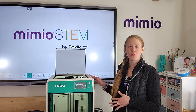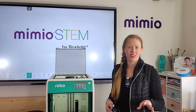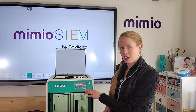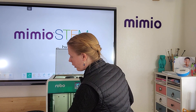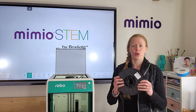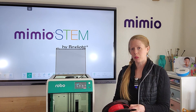Once you've cut the spool of filament and unloaded your previous roll, both loading and changing filament are exactly the same. Click start in the bottom right corner and get your new spool of filament ready. When you click start, it will begin preheating your 3D printer. So grab the new spool you'd like to use and feed it onto the back of the machine.